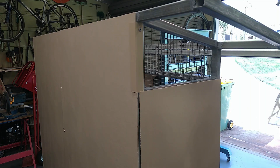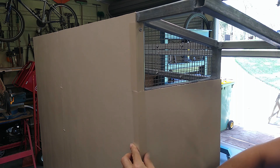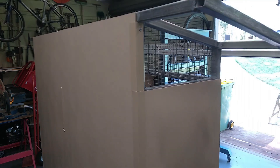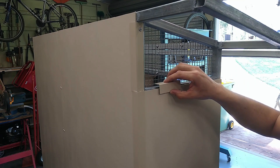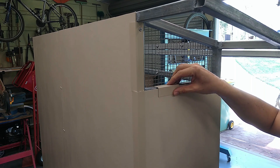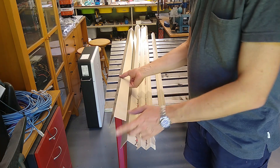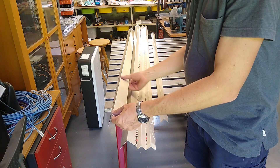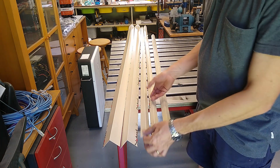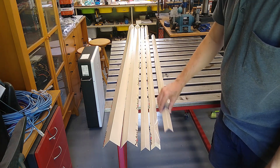I've just given the fibre cement one coat of paint because I really wanted to get at least one coat under the flashing. Using flashing like this is a fantastic way to hide rough edges - it's so easy and so quick. I screw it in position and then add the flashing just like so, and it really makes the whole thing look so much better - it really finishes it off nicely. I'm using colorbond for the flashing, I think 0.55mm thick. I just went to a hardware store, told them the sizes and lengths I wanted, and one week later got it all back. Easy.